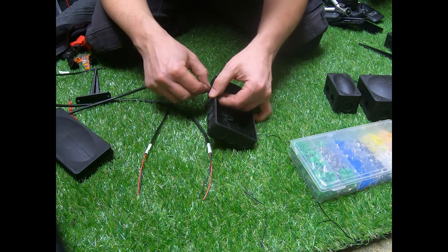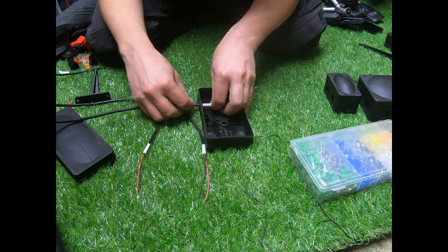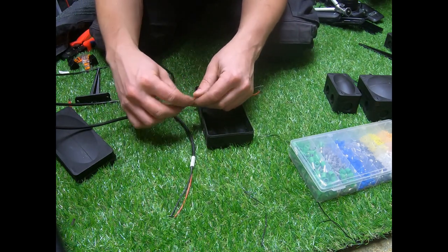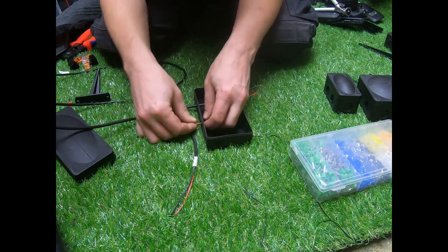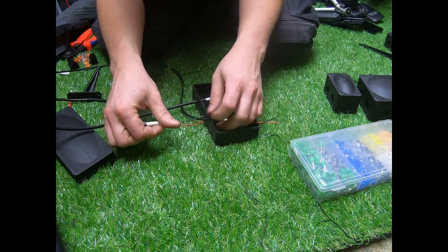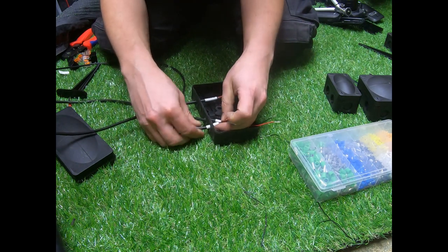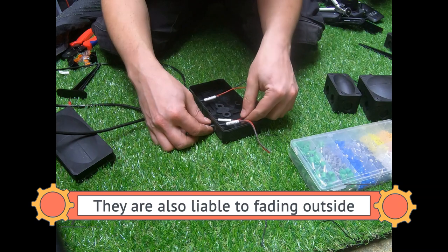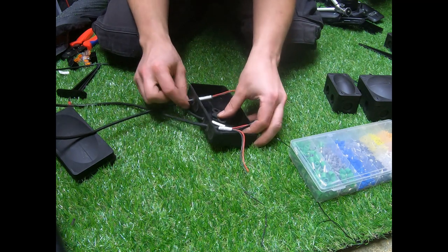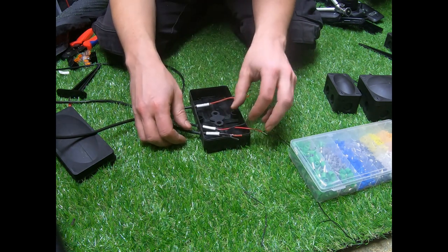Push the cables straight through the membrane. Sometimes it's a little bit of a struggle to get your cables in so you have to use a screwdriver to punch through, but it looks like we've got away with it this time. When you pull your cables in, you want to bring them a little bit longer than they need to be inside the box. I'm bringing the labels inside the box — aesthetically they're not great for the client to look at outside. I'll pull back just a touch on each one so the membrane pops out slightly.